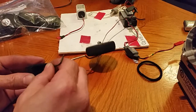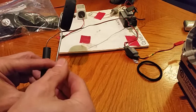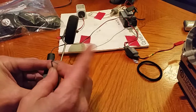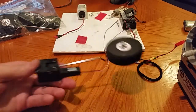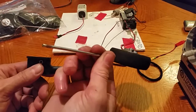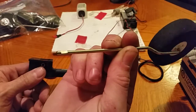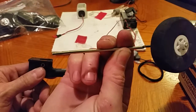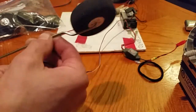You don't have to take it all the way out — that one just kind of came out. Go on the other side, loosen that one up. I've already kind of pre-loosened these so I wouldn't have to back them all the way out. And then that's pretty much it — after that the gear slides out really well. And you can see the notch in there for the grub screw to grab onto on both sides, to lock those in, to make sure they don't rotate in any way while it's in there.